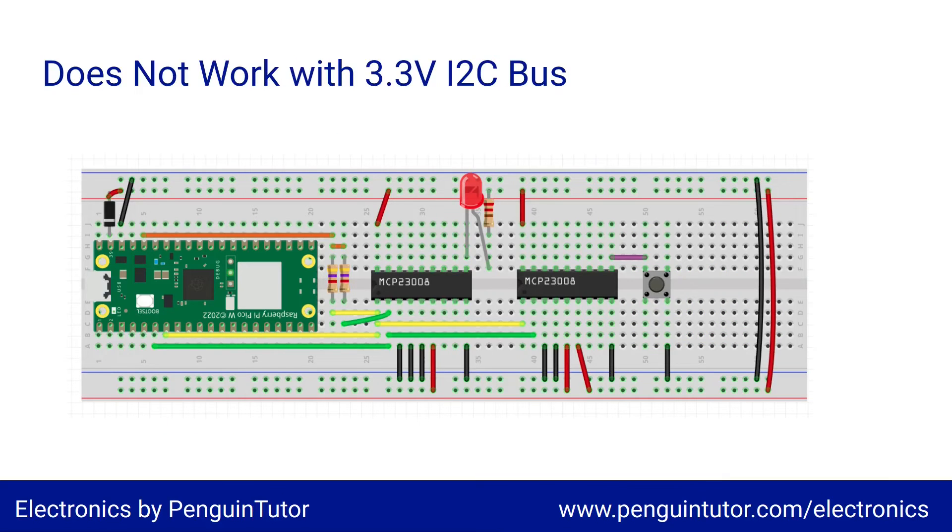This is my first attempt at prototyping the circuit on breadboard — please note this circuit doesn't work, so don't try to make this one. The circuit is designed to be powered by a 5-volt supply, not strictly necessary for these LEDs and switches, but I'm planning to add other devices that run at 5 volts. It also means I can run the electronics off the same 5-volt supply used for the Pico. Since the Pico GPIO pins do not work with 5 volts, I used pull-up resistors to the 3.3-volt supply for the I²C bus.